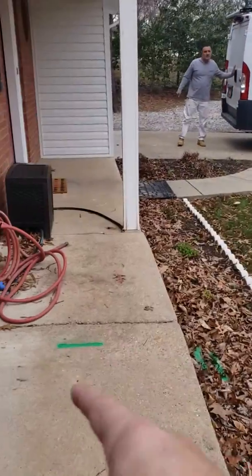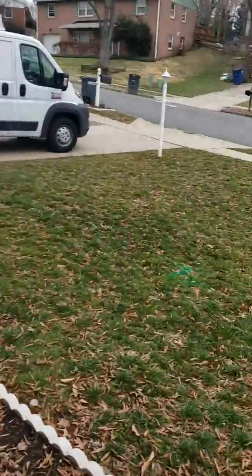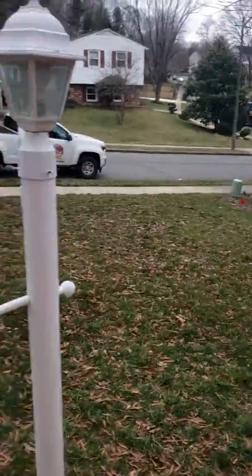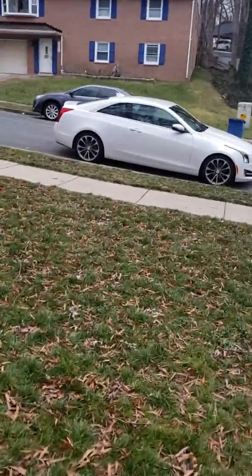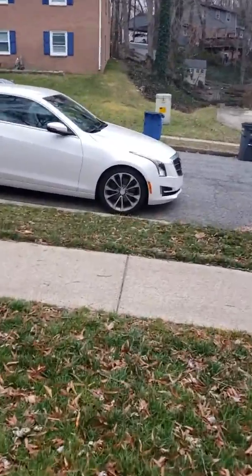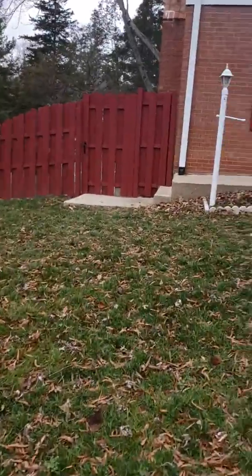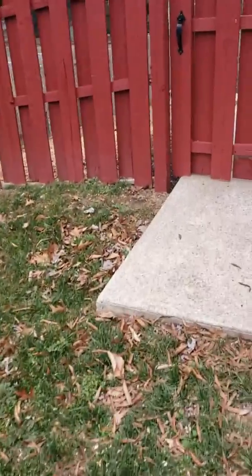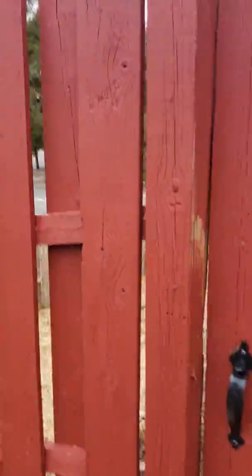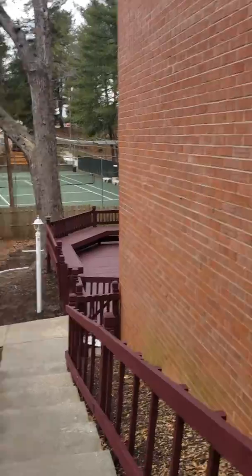New clean out right here — put this piece and that piece back, new piece when we're done. It's 20 feet outside extra. It's 15 feet that we're going to be digging at 9 to 11 feet deep. And inside, it's 30 feet long, plus the extra 4 feet, plus that, plus all the laundry line work.